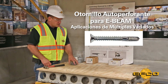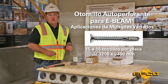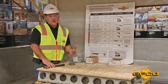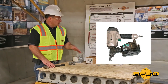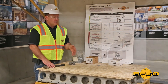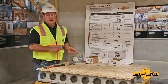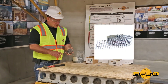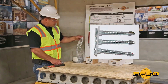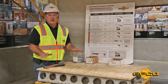It is recommended to use the same 15 to 16 screws per 4x8 sheet of plywood, the same as the multi-pour nail. Some projects are large enough with multiple gangs or shoring towers that some customers prefer to use a nail gun or an automatic feed screw gun to fix the plywood to the E-Beams more productively. For example, if you're building a stadium or a parking garage and have several decks to build, you might consider the use of these tools. E-Beam nails can be wire collated, as you can see here, and the E-Beam screws can be fixed to strips for use with these tools when necessary. But you wouldn't do this for just a few gangs on a small project.